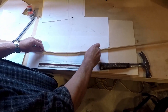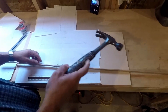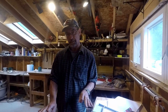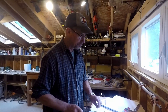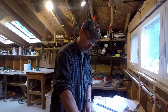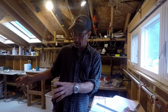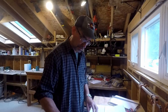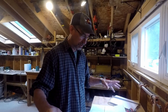I've been experimenting with the amount of space inside the boat. What traditional boat building does is take these sorts of drawings and translate them into a full-size layout on the floor of the shop — they call it the lofting floor. That's called lofting the boat. You get all these measurements and make sure they actually lay out, and then you have full-size patterns to cut your pieces to. I've never done that and we're not going to do it on this boat. But the danger is the thickness of a pencil line translated to full size may be a quarter of an inch, so you really need to pay attention to the curves.